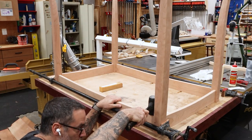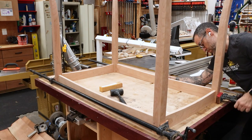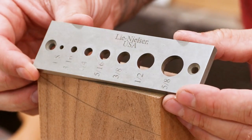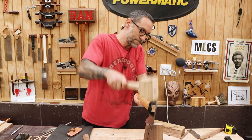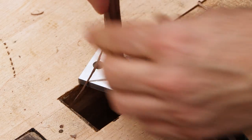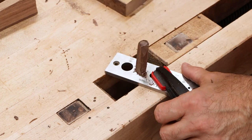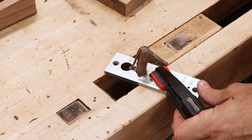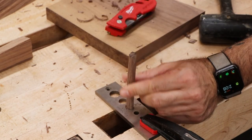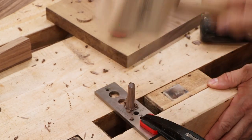Make sure that your aprons are flush with the tops of your legs. For the dowels, I'll roll my own. Commercial dowels are often weak because the grain usually runs out to the side. If you make your own by riving the wood so that it splits along the grain, you can ensure that you have the strongest dowels possible without as much of a chance of them breaking under pressure. It's also super fun to swing a hatchet around the shop and then beat the heck out of some wood pegs with a mallet.